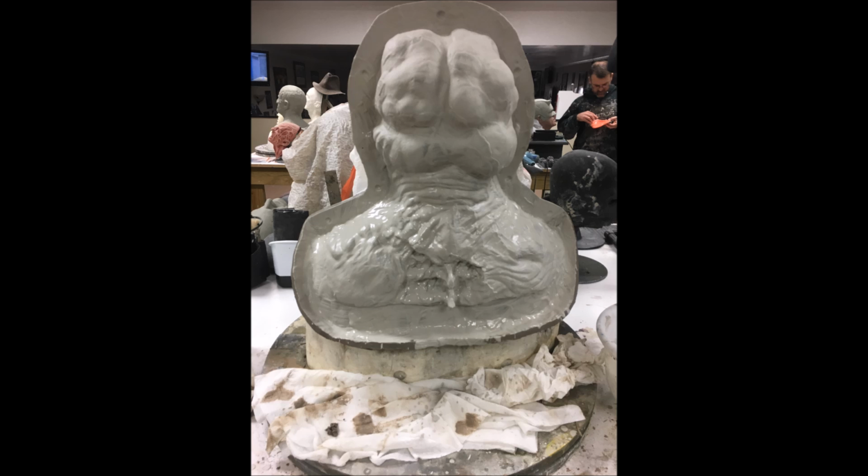The way you mix your plaster, this is Ultra Cal 30. It's a gypsum cement. It's an industrial grade plaster. It's super hard, super strong stuff. Comes in a powder, and you mix it with water. You don't want to mix it too much. You don't want to mix too much up, especially for these first few coats. You just want to mix a little bit.